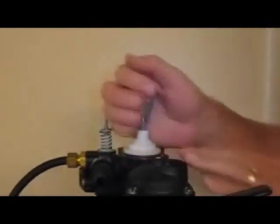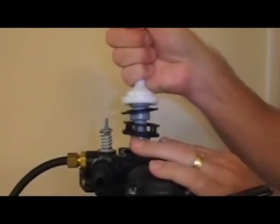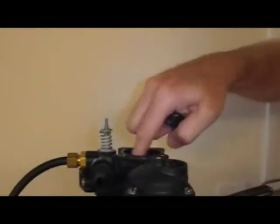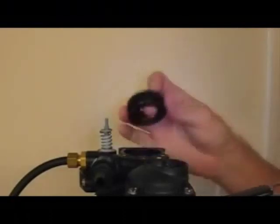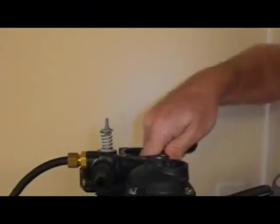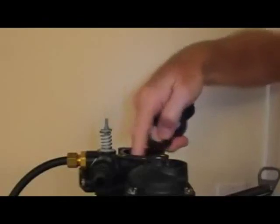You should be able to wiggle the main piston out. A couple of seals and spacers may come with it, and you can pull the rest of them out with your fingers. Now if you've got a lot of hard water or iron, you may have to pry the ones in the middle out. Average water, you can fish them out with just your fingers.